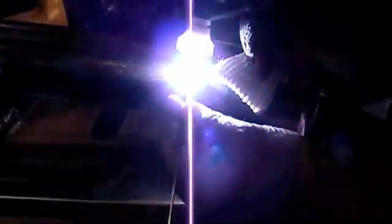I taper off nice and slow so I don't leave any pinholes or fish eyes. I'm using a back-step technique — weld about an inch, then back up and weld about an inch into where I just welded. I noticed I'm getting into a bit of a bind. Just about done, but I noticed a crack opened up on this side too, so I need to get the Tootsie Roll out and clean that again. The rest of it went pretty well — it's not going to look great with that big nasty MIG weld right next to it, but it'll be okay.